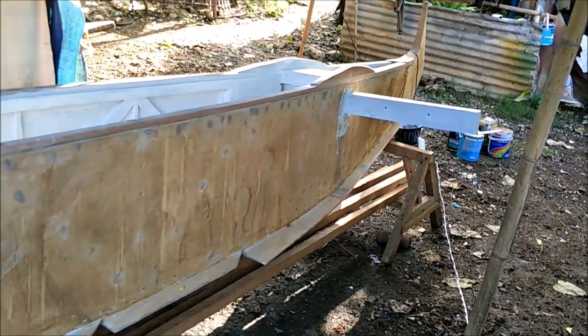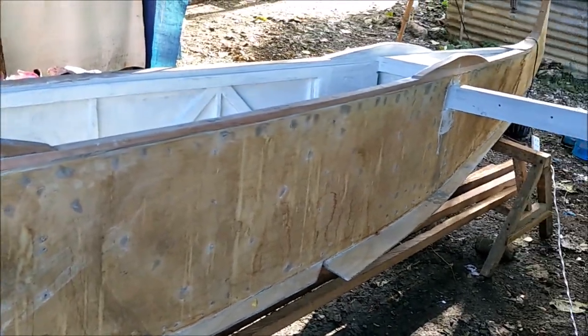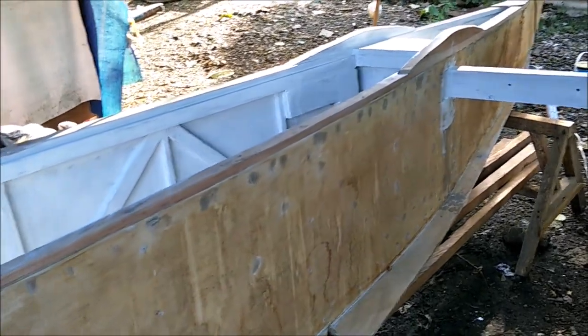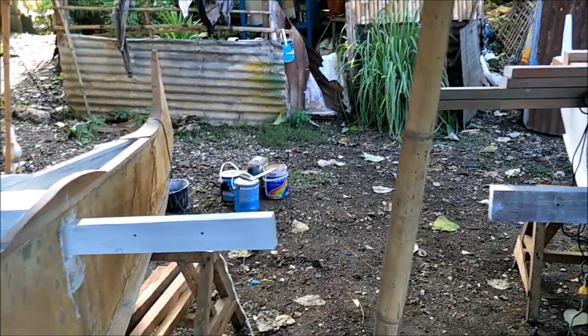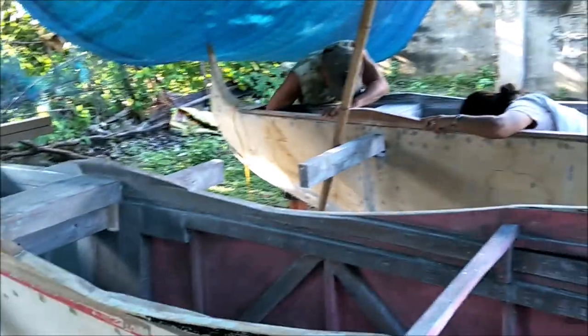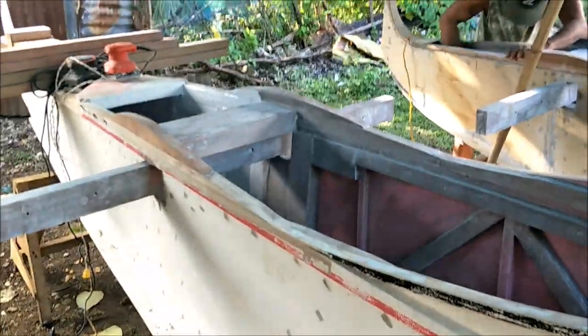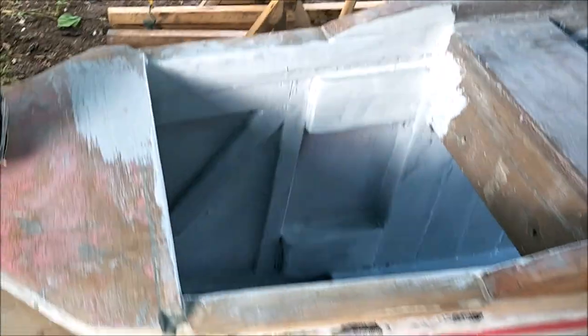After the glass coat we've got to epoxy the outside with two regular coats of epoxy with thinner, then one epoxy coat with white paint, then some sanding, and then we start painting with regular quick-dry enamel. We're going to finish painting this hull. It's 4:30. They're sanding, I'm gonna go paint.